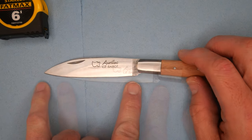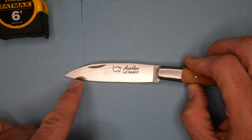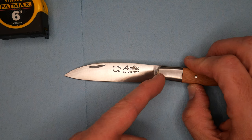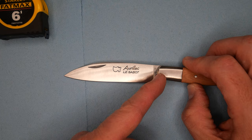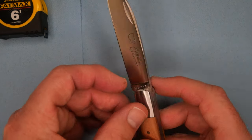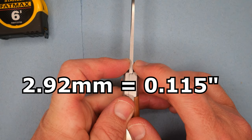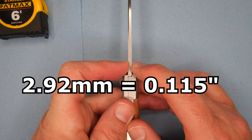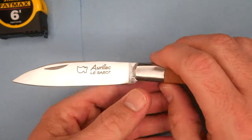The length of the cutting edge is 84.3 millimeters, 3.32 inches. Blade length — tip to the bolster — is 87.6 millimeters, 3.45 inches. The thickness of the blade, measured up here at the ricasso, is 2.92 millimeters, which is 0.115 of an inch — so they started with three millimeter thick stock.